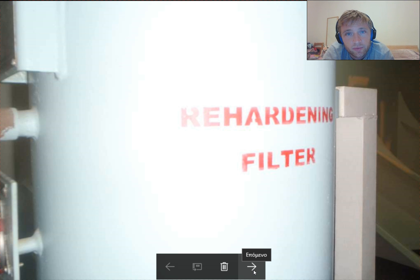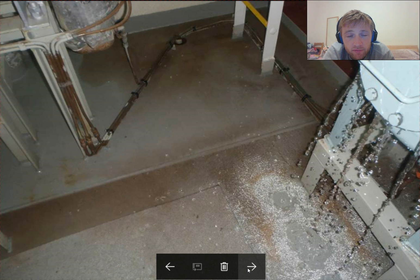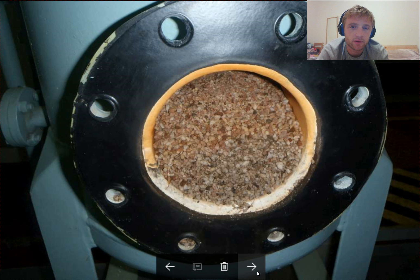On the last ship, this filter was not cleaned for eight or nine months, maybe more. It came up in the PMS system and we tried to fix it. First of all, we bypass this filter to understand — this is the drinking water passing through here, taking some minerals from the stones and filter, because from the evaporator the quality of the water is very bad.